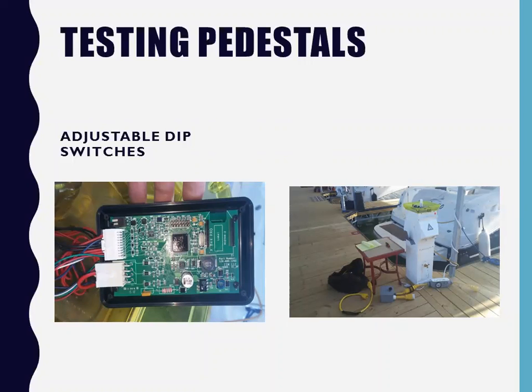I went ahead and I brought a rheostat with me, you know, to create a ground fault. And I clamp metered over the hot and neutral wires to one of my sensors, and it literally did exactly that. It activated at 25 milliamps. So I knew the circuitry was working correctly, and it was doing what it was supposed to do.